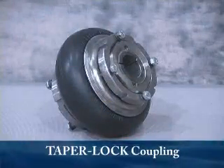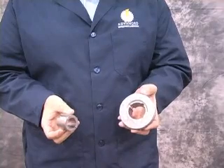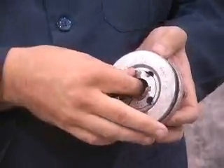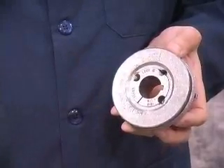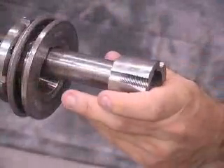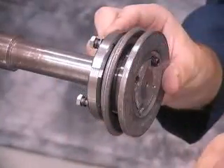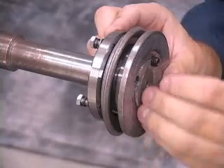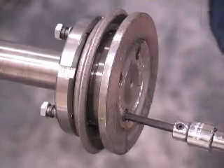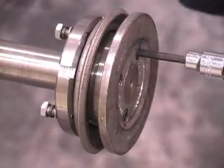Now let's review the installation process for the Paraflex G-Series taper lock coupling. The first step in the taper lock flange installation is to insert the Dodge taper lock bushing into the flange side of the hub. Make sure that the bushing and hub holes line up. Each hole should only be threaded on either the hub half or the bushing half. The holes threaded on the bushing half are used for removal, while the holes threaded on the hub are used for installation. Place the assembly onto the shaft, allowing for a small amount of axial movement of the hub during installation. Using a torque wrench, apply torque to the set screws alternately to tighten the bushing onto the shaft and into the hub. Ensure that the hex key used to tighten the set screws is not worn, as this can result in a loose assembly or damaged set screws. From this point on, you can proceed with installation of the element as previously shown.